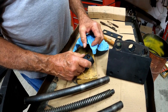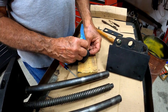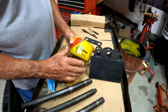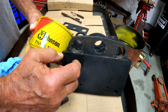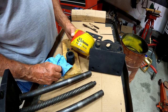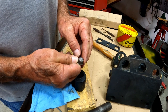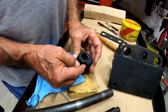I don't use any type of oil lubricant on this, because if you've done any woodworking for a while you know that if you use oil on something and sawdust gets on it, it's going to clog it up. This is what I put on it — it's Johnson's Paste Wax. It'll keep it from rusting and protect it. I don't know how it'll work in winter; it might make it a little harder to slide, but you definitely don't want a thick film of paste wax on this pin. It needs to slide back and forth really easy. I put a little wax on it mainly just to keep it from rusting.